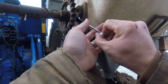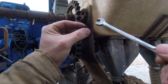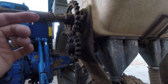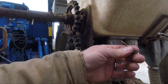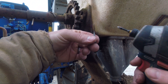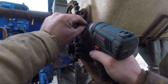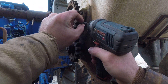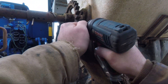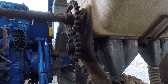Fortunately this one wasn't too tight, because that would have been a booger. Alright, you can see the back side of the fitting — the grease is going through the grease fitting, it's just this hole is plugged up, more than likely from years of not being greased properly. So what we're gonna do — a drill bit would work, but I just took a screw and cut the point off of it so I can get the threads to go all the way to the bottom. You don't want to get carried away because you don't want to damage your shaft. You can see all that goop and rust it just bored out of that hole — that's the reason grease wouldn't go in there no matter how hard I pressed on that grease gun.